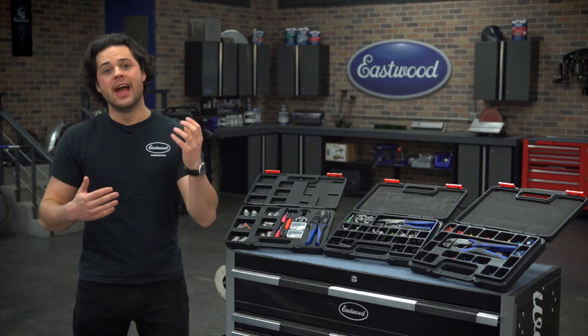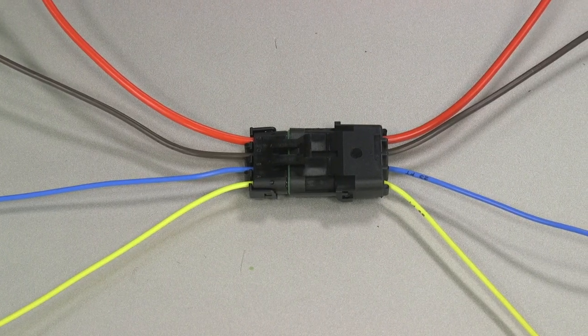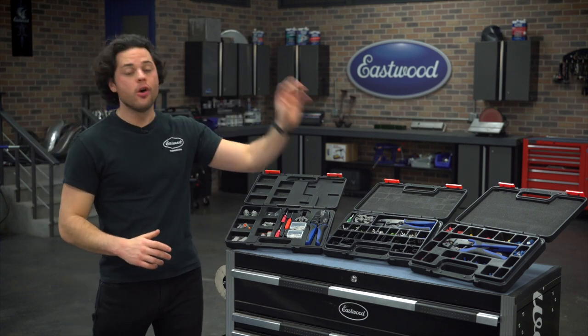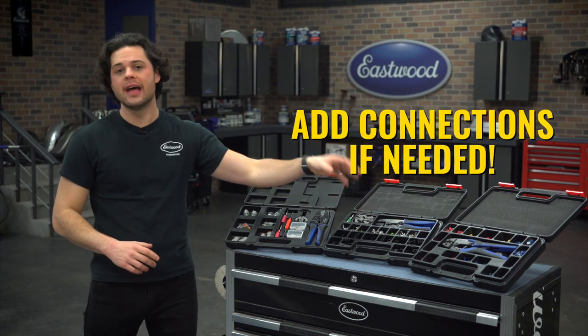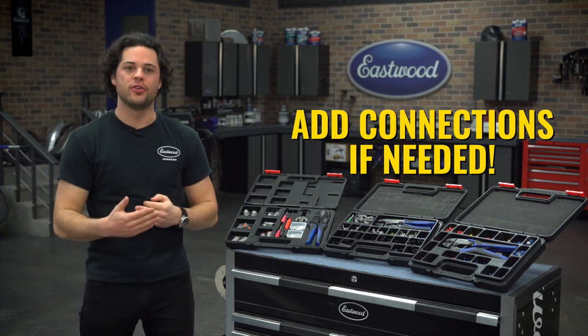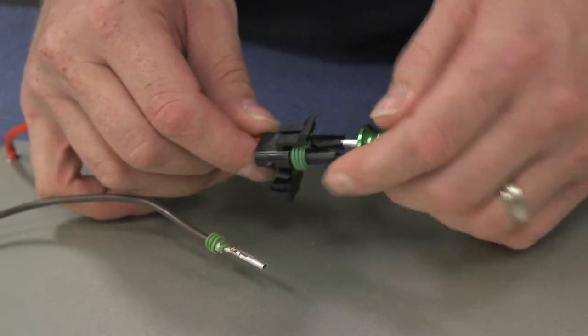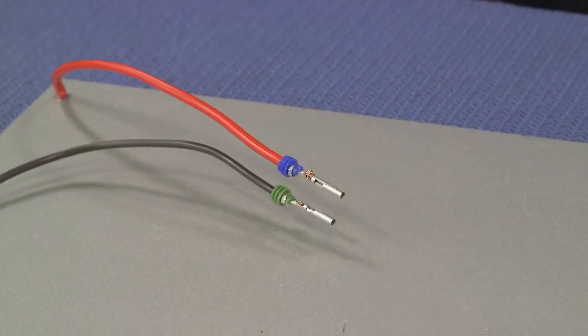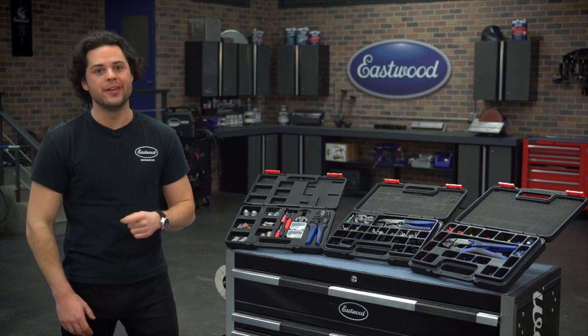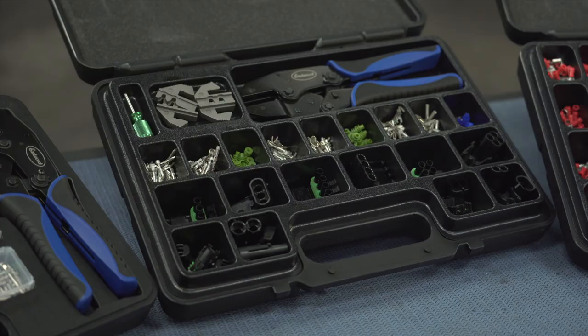Very solid, and you get a fold-over locking tab just to keep the seals in place. The nice thing about these connectors is that they are completely scalable. So if you have a three-pin connector and need to add another wire, you can disassemble what you have without cutting off anything and add that extra wire into a new larger connector. All the tools you need to disassemble one of these come included in the kit.